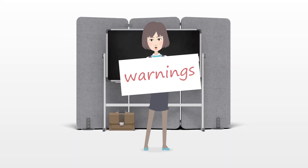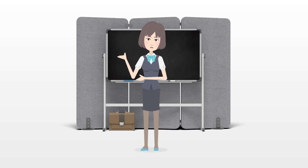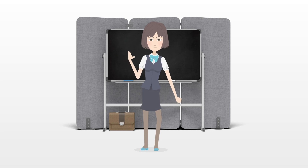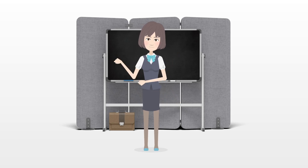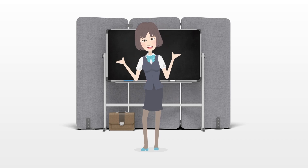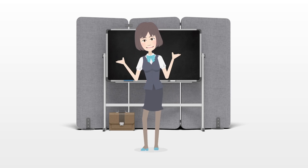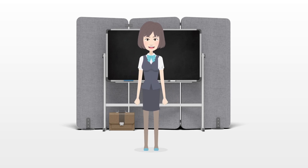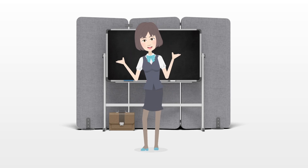Warnings: If the seat of the chair does not have right angles at the front two corners, you will have to fill in the gap with short, individual strands. Do this by tacking it on the inside of the left rail, wrapping each one around the front and the left rails, crossing along the front rail, and then wrapping it around the right and front rail. Tack it on the inside of the right rail.